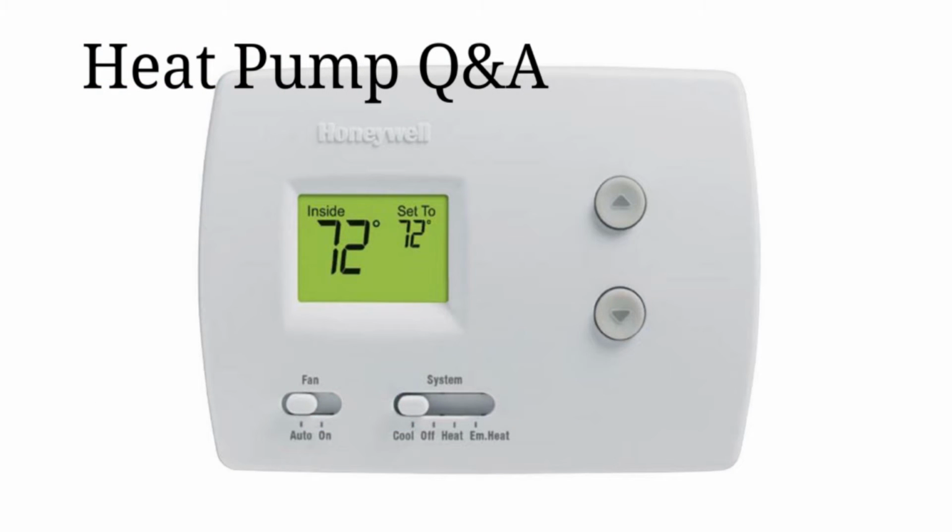So the next question is, my heat pump thermostat reads aux heat, the other one reads emergency heat, what's the difference? Basically, like I explained before, your aux heat will come on automatically when your system senses that it's around 35 or less than 35 degrees outside, and it can no longer efficiently heat the air in the home to the desired temperature. Or it'll also turn on if the system outside is just too cold and it needs to warm itself up to defrost and melt some ice that has collected on it.